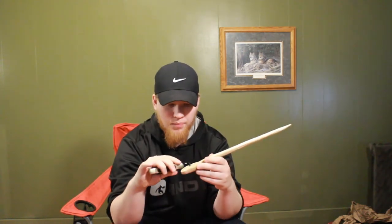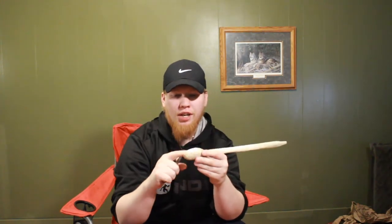But with this side gouge here, and how it's so small, because it's just a little gouge with the edge on the side, and it's at a 90, I could make this bowl long and skinny. I could make it really fat and round. I could make a big bowl out of it, you know. And it gave me the control. I wasn't scared of burning through. I wasn't scared of getting a hole all the way through it because I could feel where everything was. And so this was the game changer.